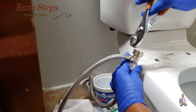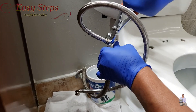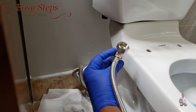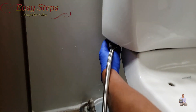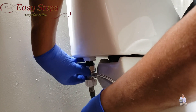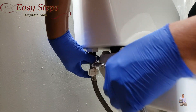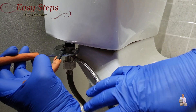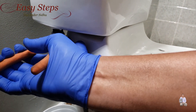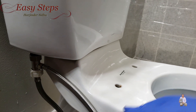You really don't have to force it — this is snugly hand-tight. The other side goes on top; we're going to put the teflon. After adding the teflon, we're going to tighten it. For this one you need to tighten it with a wrench or a plier — I'm going to use a plier. Nicely tighten. This side goes on the valve right here. Once it's hand-tight, we're going to tighten it with the plier. You don't have to over-tighten — this is really good, nicely tightened.